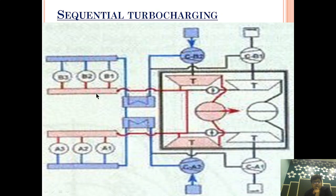This is the exhaust manifold and this is the scavenge receiver. The exhaust coming out from here is fed to this turbocharger, which is also connected in parallel to the other turbocharger. The same exhaust coming from the second unit is fed to its turbocharger and connected to the common line.